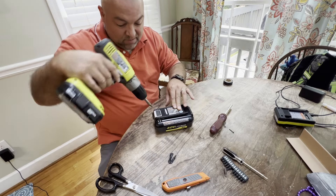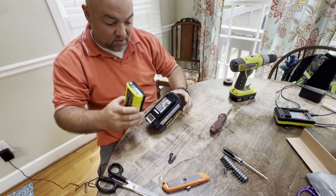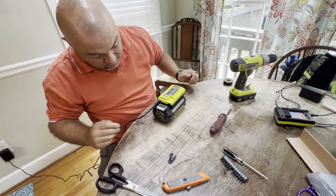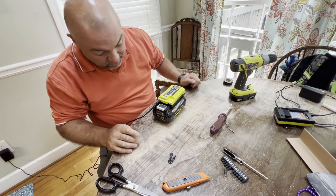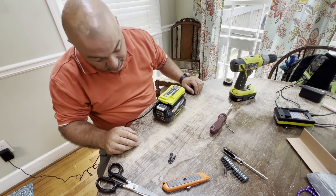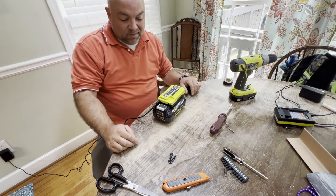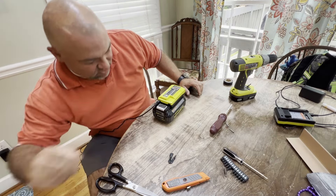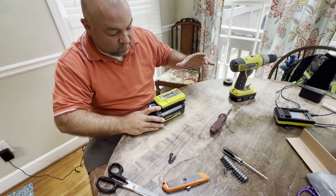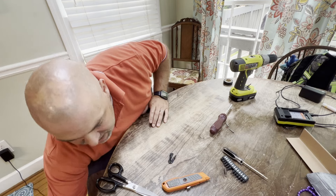My lesson last time was before I click the button, we're going to take the win if the charger just shows that it's charging. Right here as you can see, charger is red — if it starts blinking red, we have a problem. I'm going to slip the charger on. We've got two lights showing blinking green, which I think is a good sign. Now it's blinking red, so I don't think that did what I needed it to do. This battery very well may be fully defective. We're going to let it sit on charge for a while and see how that goes. I may pull the top off again and try another reset — you may have to experiment with this a few times. Blinking red still, so that's probably not a good sign, but we'll set it to the side and work on the other one.